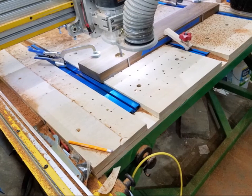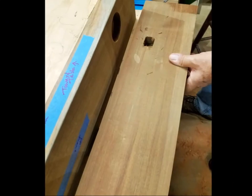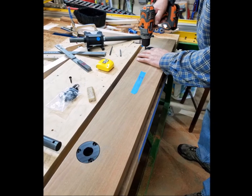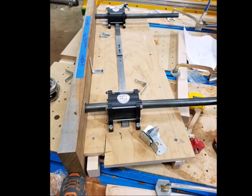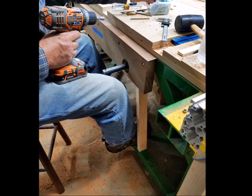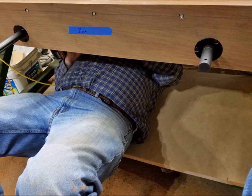Then with confidence that we gained from the rear jaw, we went ahead and bored the counter bores and the rectangular holes that allow adjustment for the front jaw. We set the shafts in place again and after ensuring that the shafts move freely through the jaws we placed a strip of wood between the fronts of the jaws and the backs to keep them aligned. We mounted the Delrin bushings in the counter bores of the rear jaw and set up the housings again, this time with the gear racks under the pinion gears and fastened everything in place. We flipped the plywood over and bracing the assembly under the CNC table, we mounted the jaws to the steel frame with number 12 self-tapping screws countersunk into the jaw. Bill then crawled under the table and fastened the plywood to the steel frame with those same number 12 self-tapping screws. I tried but I couldn't push the screws through the eighth inch steel over my head.